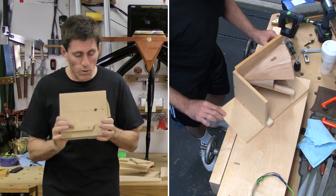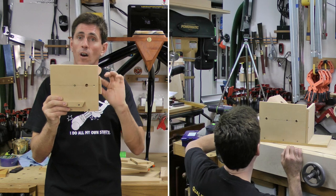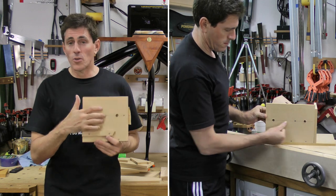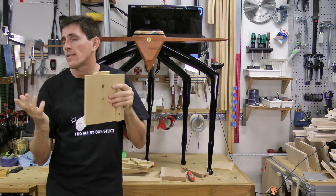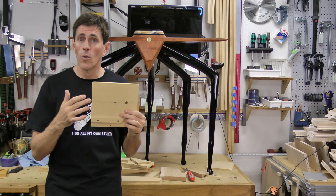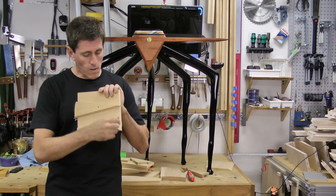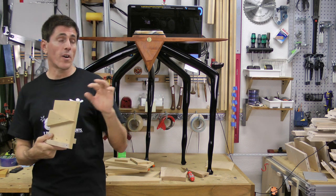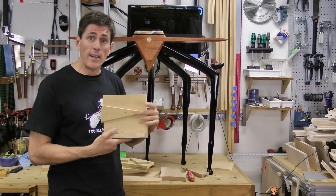And what I can do is I can look through the two half-inch holes, another one being here, and I can sight for the center line that's on the triangle, and I can make it parallel to the line that's here. Now, ideally with the screw going through the center line and being tapped in the center line here, the line should exactly line up. That's not the case. The line was just a little bit below the center line here, but it was trivial with the two sight holes to make it level and parallel to the line here, which meant that the center line on this triangle was parallel to the deck of the saw. That's really going to be important for the cut that's on the top here, because this cut is going to be, you know, 90 degrees to the bottom.